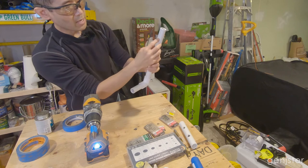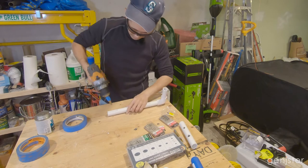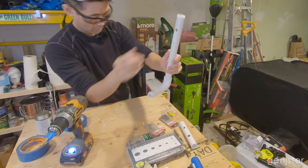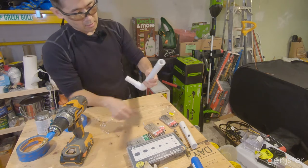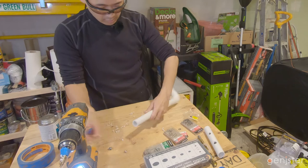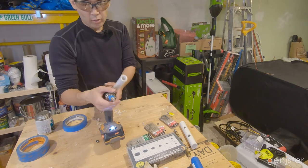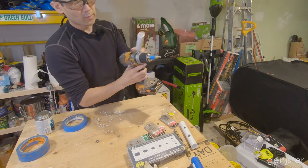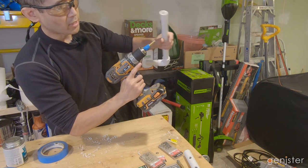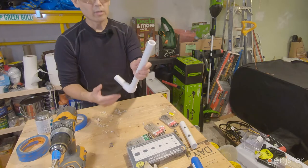You only need to make the half-inch hole on the inside edge of the PVC tubing — you want these holes to remain small so the washer doesn't go through. I go ahead and start off slow. It makes a really nice hole. I double check that the washer fits in — it just needs to be a little deeper. Now it fits in perfectly. I'll do the same thing on the other side. One thing to be careful about is how wide the step-up bit gets and how fast — make sure the tip end doesn't start going into your material on the other side. I already checked, so I knew it wasn't going to go through. It fits on both sides. Now I can install this on the bucket.